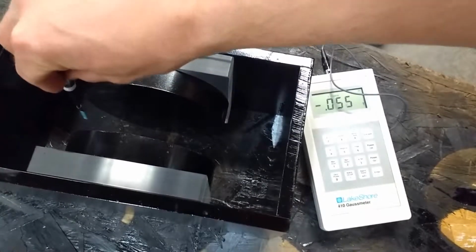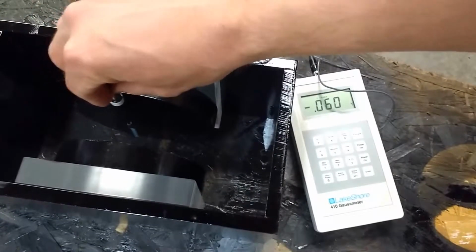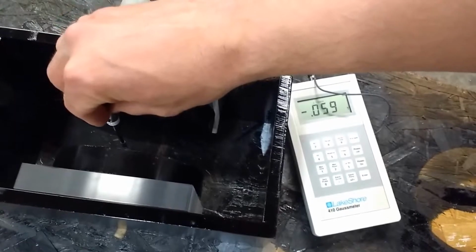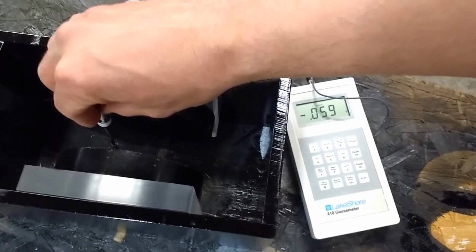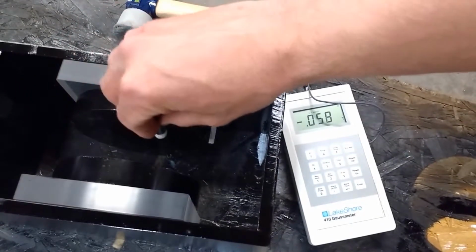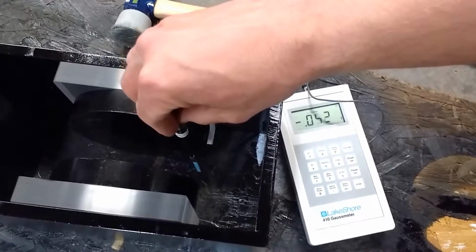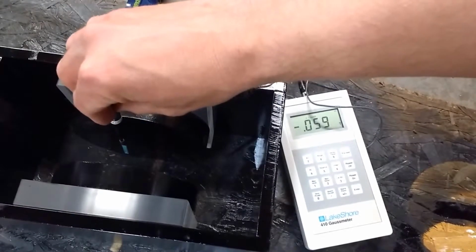And I can really move it over a pretty wide range, and it stays right about there until I get to the edge of the magnet, right? Even if I move it pretty close to one end or the other, to one pole piece or the other, it actually only fluctuates maybe 1/1000th of a Tesla, which is pretty good uniformity. And I can bring it over to this side before it really starts to drop almost to the very end of the pole pieces before the magnetic field really stops to drop down a lot.